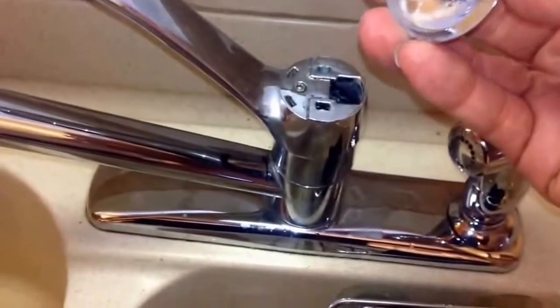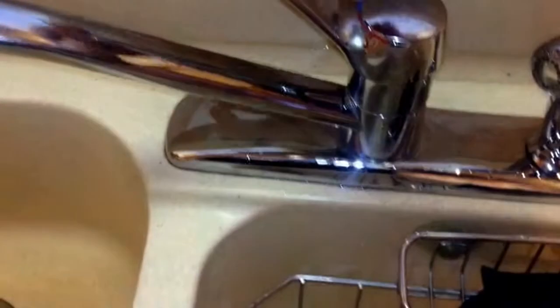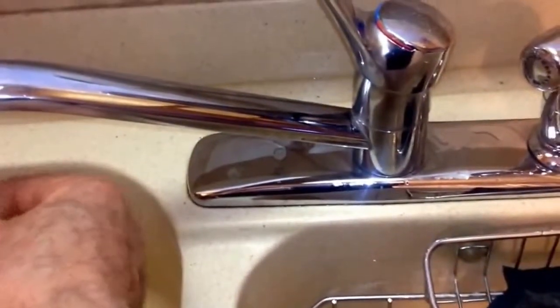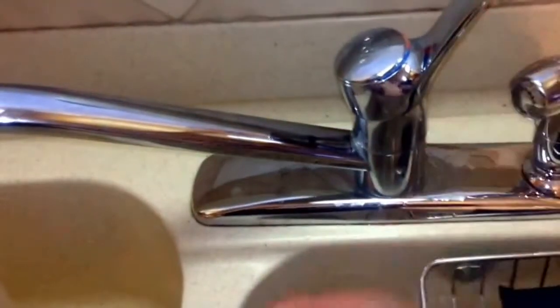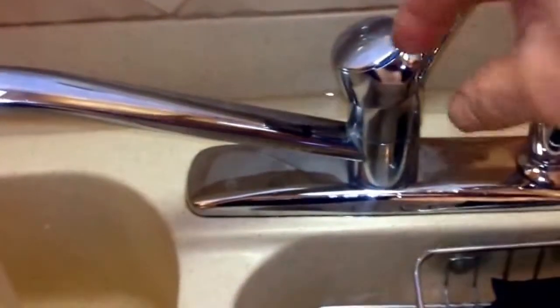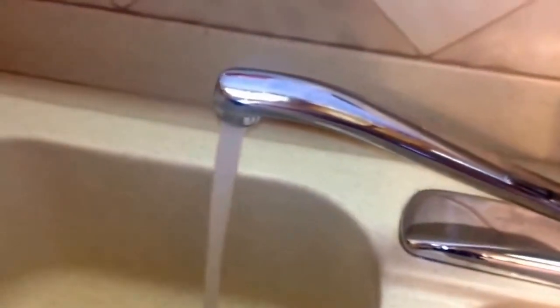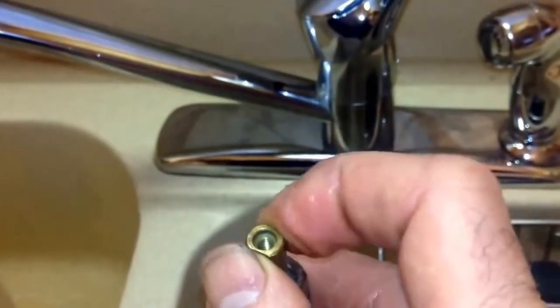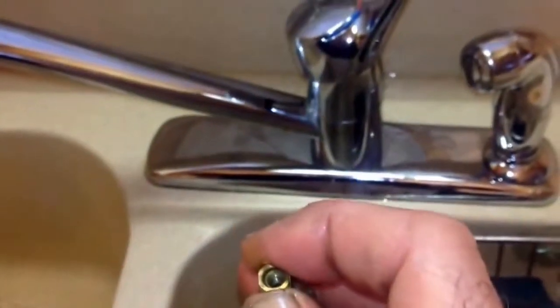Then we put on our cap — we got the hot and the cold — and we'll start them up. Red is just for hot, and yep, that's nice hot water. Once you push it over the other side, we got cold water. Now if you got it just the opposite, you can take the thing apart, take the head of the valve, and turn it 180 degrees, then reinstall it.